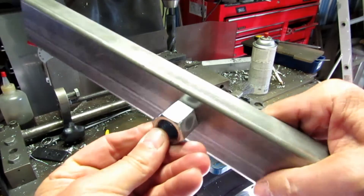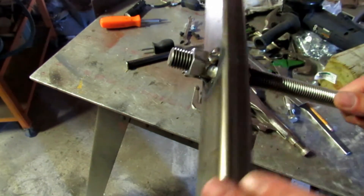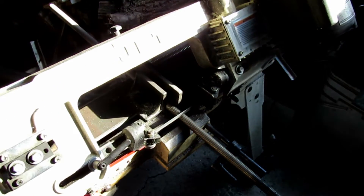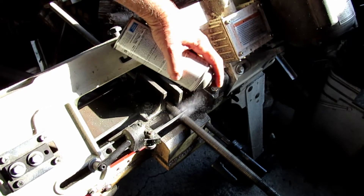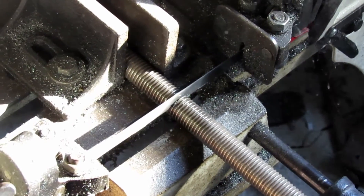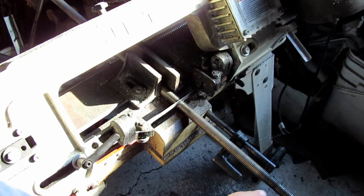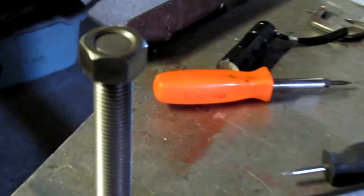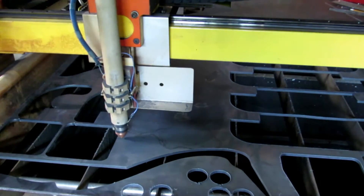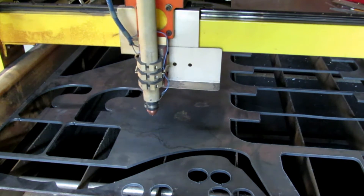There it is — just a three quarter inch coupling nut. I put it through the hole and tack welded it on both sides to hold it in place. That was a steel nut tack welded to stainless, but I've found you can weld them together. There's the stainless threaded rod — which I probably should have never used because I never thought about the galling properties of stainless. Then I just took another nut and welded it on to the end so I could drive it with just a socket.